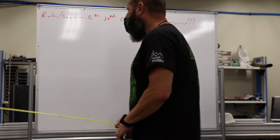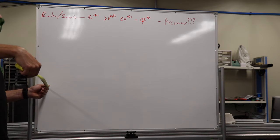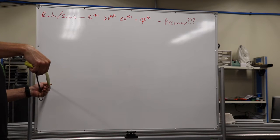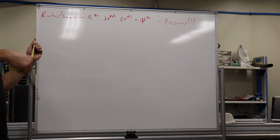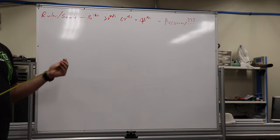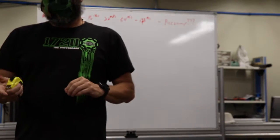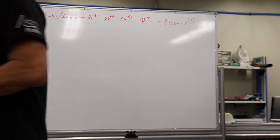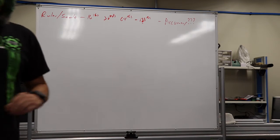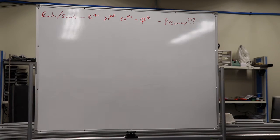So if I were going to measure up against this and measure out, the little foot moves in, and now this is a quasi-accurate reading. Whereas if I were to measure to the outside of that, again the little foot moves and gives me an accurate reading. So it moves the width of the little foot. Okay? So tape measures, pretty handy, again more carpentry related than anything. As somebody who's working on metal and such, when might I use a tape measure? Joaquin, when would you use a tape measure?